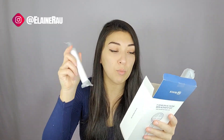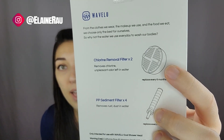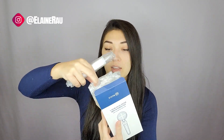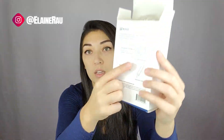This filter basically removes rust and dust in the water, and you want to replace it every three months. The head with those balls in it over here helps remove chlorine and unpleasant odor left in the water — so there are two separate filtration functions. There is also a replacement head in here, and that you want to replace every six months.